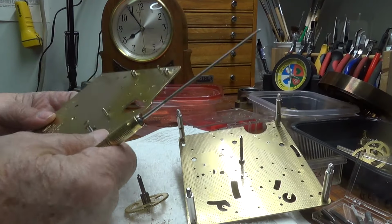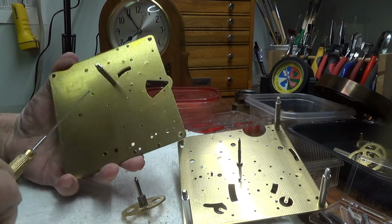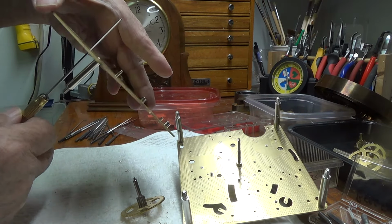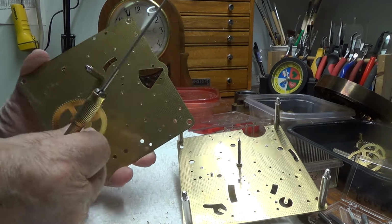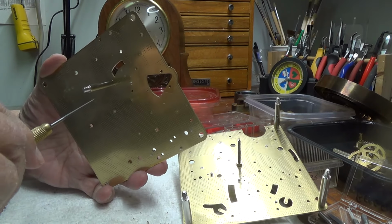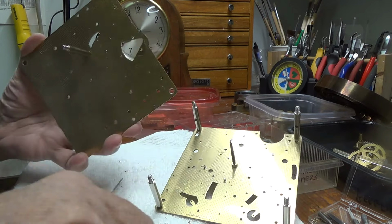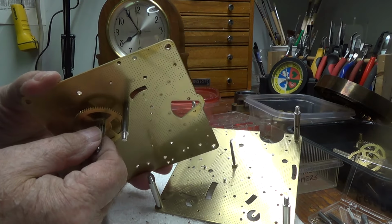All right, now what we do is we pick a cutting broach that's going to fit in the hole, like that, before it starts cutting. Okay, so now I know that this is close, so I'm going to start from the inside, put the cutting broach in, turn it a couple of times, keeping it straight, and then we check. Yep, see that one in.